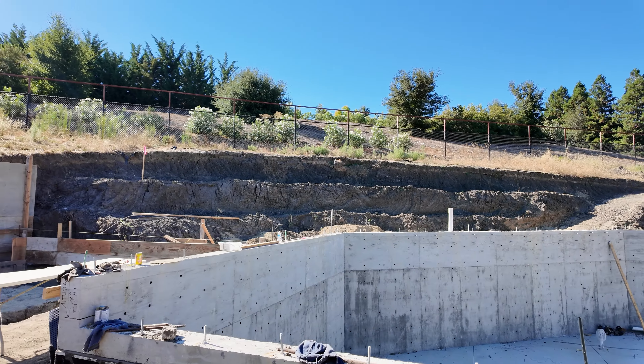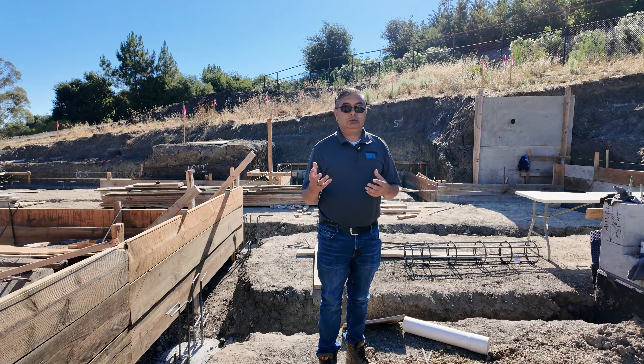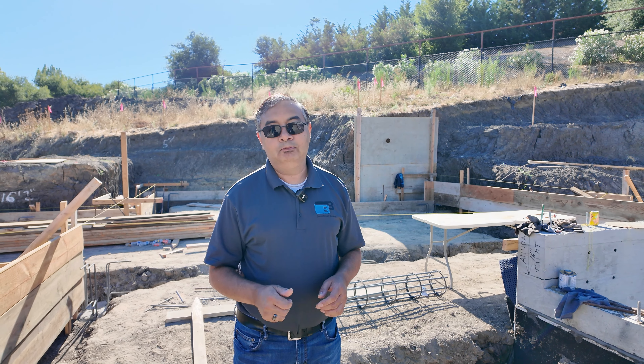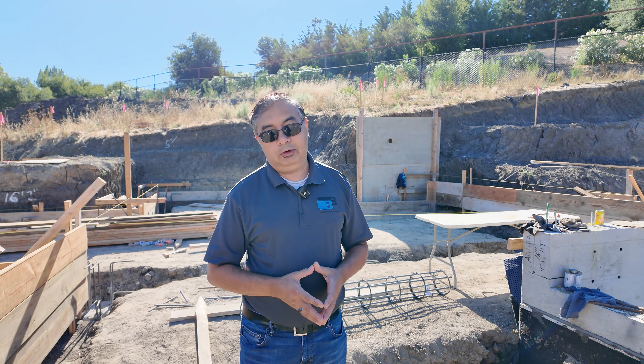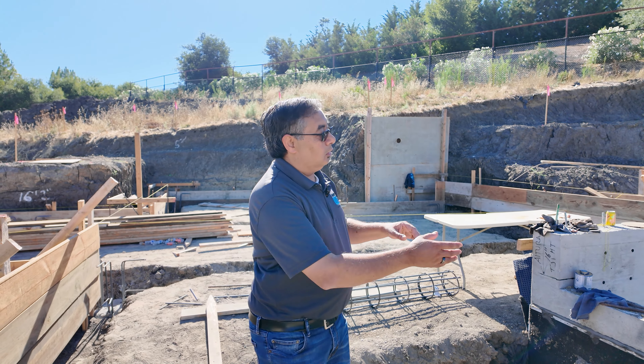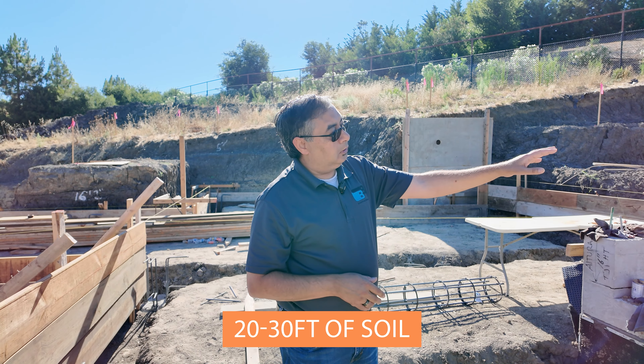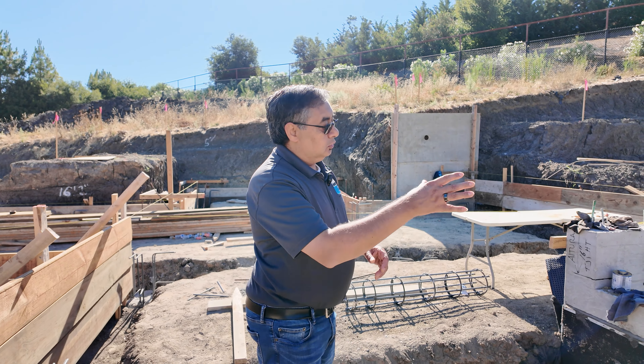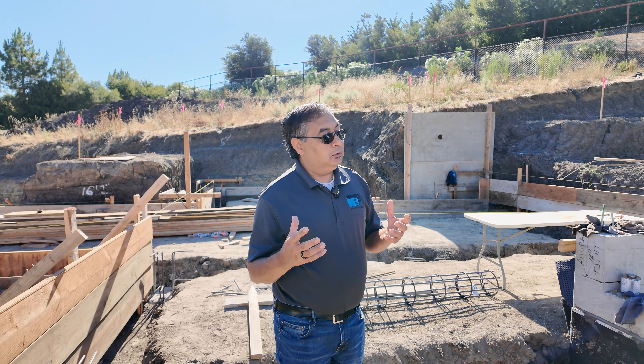This project is built on a hill. You can imagine the elevation and how much we've had to cut into the hill and how much soil we've had to export. For this project so far, we've exported 147 truckloads of soil — each one of those big trucks you see on the freeways. The distance from the natural grade at the top of the soil down to the bottom of the lower section is about 25 to 30 feet of soil that we've extracted and exported.